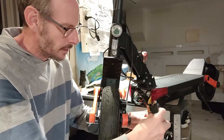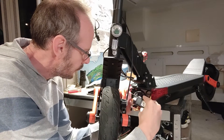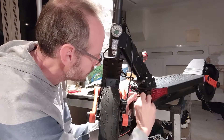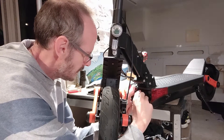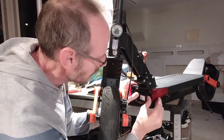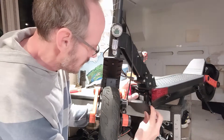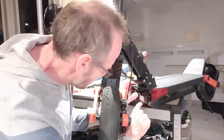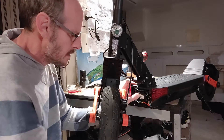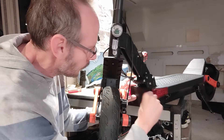Reassembling then is just a simple matter of making sure you've got everything reasonably comfortably secured — not too much pressure or stress on any of the cables. Pop it in so that it's sitting in there comfortably. With this one, I'm just going to sit it in there and let the pressure of the various spaghetti wiring that you have inside a deck sit it there comfortably. Then a simple matter of making sure that it's all clear — there's a little Phillips screw that comes up through here, so just make sure the screw hole is clear of any wiring.